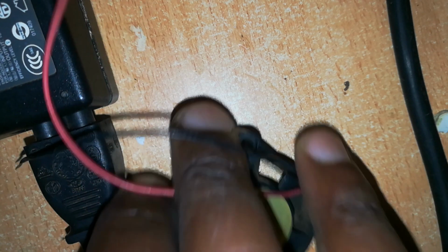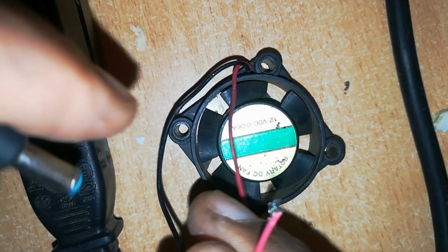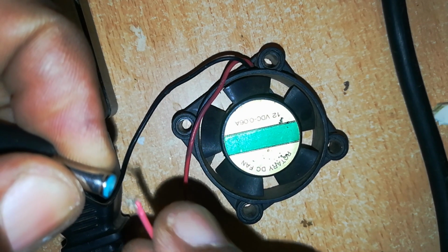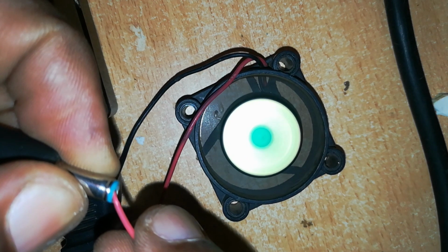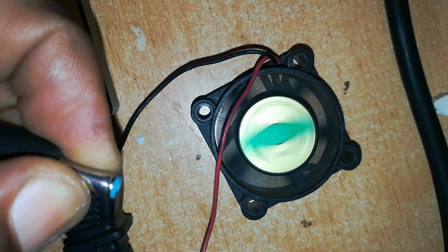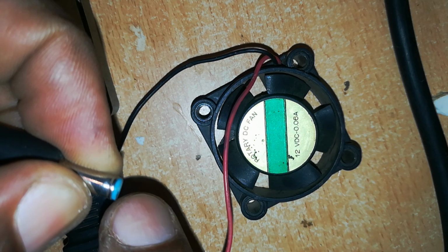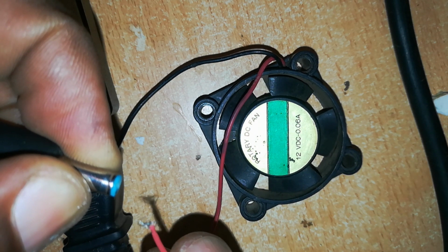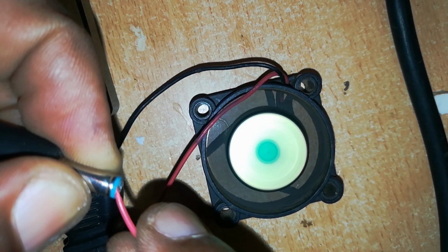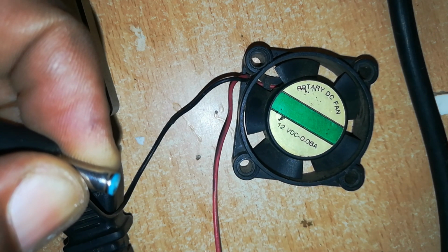That's our fan. We want to test this blue pin and see if there is any output. Positive goes to the inside. And there we are. Our diagnosis and repair has been successful. This charger is now working. The problem was the fuse and the induction coil, which we've managed to trace, diagnose and replace. Now this fan is working perfectly. And that's how you diagnose and test and repair your HP charger.